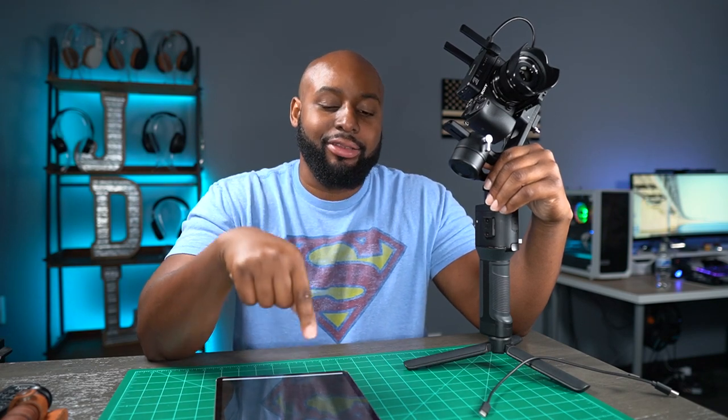I don't care what the instructions say — I've tried different combinations, different camera settings. Nothing seems to work. I can't get it to work. If you guys can get it to work, let me know in the comments. But you can use the RavenEye through the DJI app — connect the RavenEye to your camera via HDMI; the RSS cable doesn't seem to do anything. You can use the RavenEye as a wireless monitoring system, and that's actually a really plausible use, especially from a distance, eliminating the wires connecting to your tablet or phone.